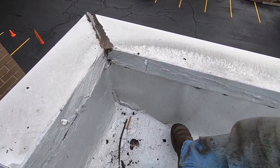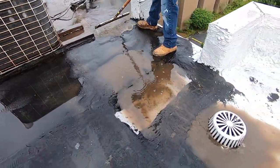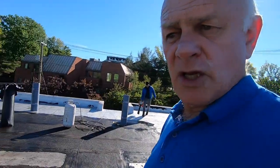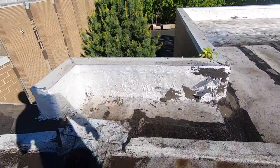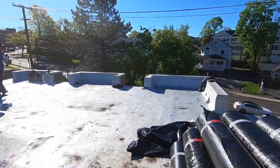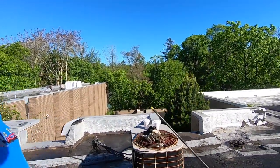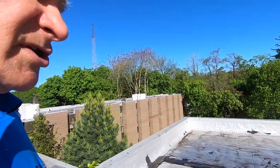Check this - it's cracked open right here. We're going to cut through this to make a channel right to this drain. This is our second day - we built these channels yesterday to remove all the pooling water on this roof and it worked very well. There was barely any water on this roof when we came this morning. It rained last night and no ponding after the rain. Now we're drying the roof and we're going to start torching.